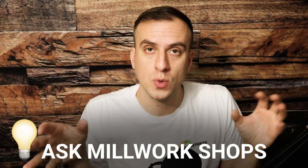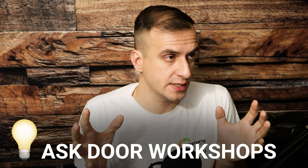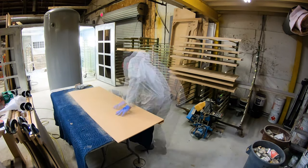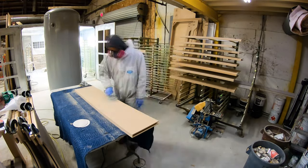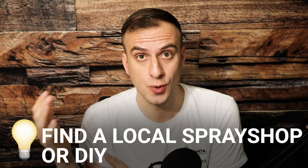When it comes to making boxes and doors, you can call around and ask mill workshops how much they'd charge to make a few boxes if you give them the dimensions. Or you can find a place that sells pre-made boxes from China or elsewhere for cheap. MDF doors and gables you can also get from a door manufacturer — they can give you a pretty good deal. Or you can do it yourself: go to the lumber yard, get some double-refined MDF, cut everything to your measurements, prep it, and sand all the edges smooth before you spray it.